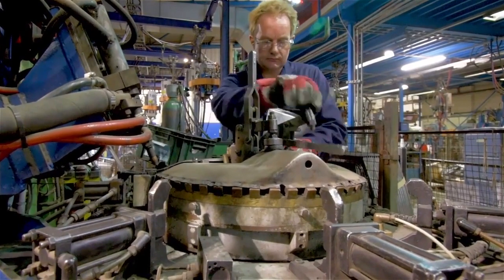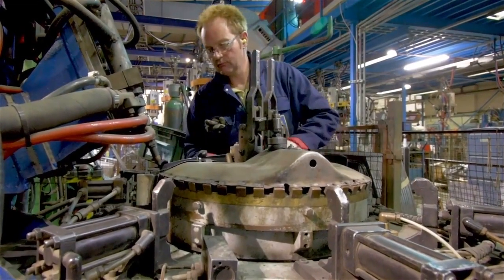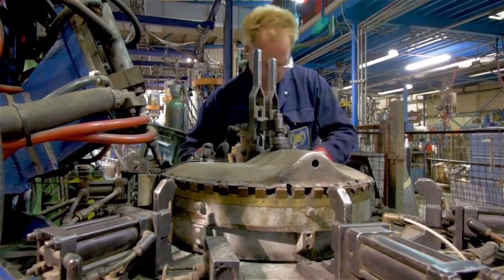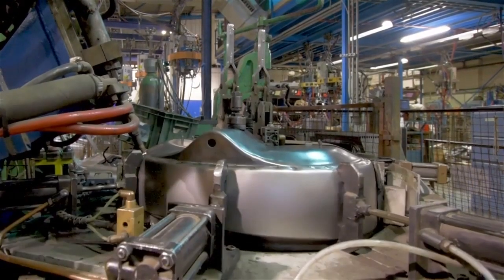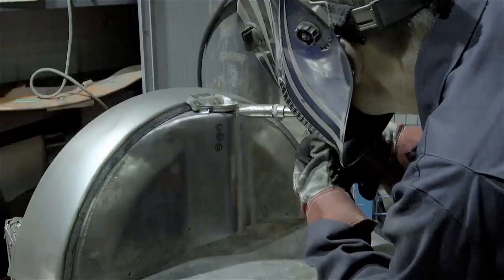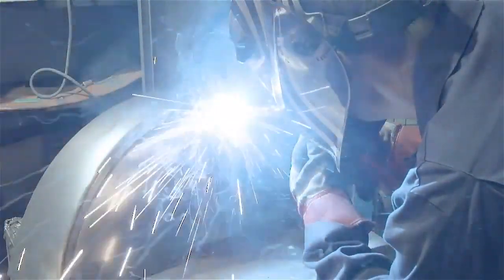As with all our body shells, production starts by building many small sub-assemblies. Parts like these rear inner wheel arches, which are the same for both early and late Minis. With the steel pressings in place on one of the original production machines, spot welds are automatically placed around the edges. Off the machine, shock absorber mounts are then MIG welded in place at the top of the arch.